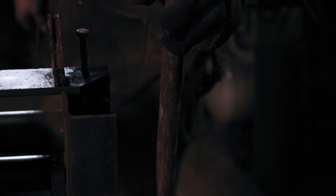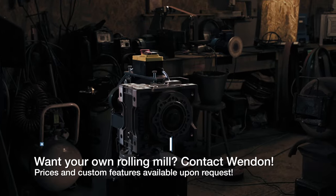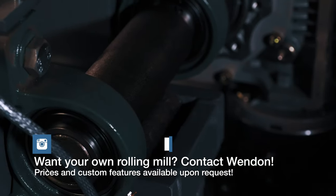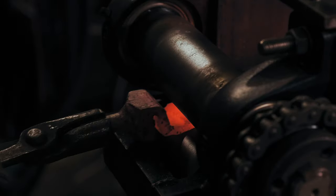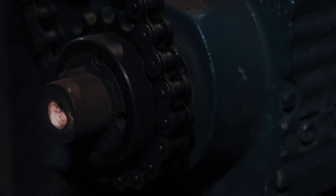There is also a side lever which works on a cam, which adjusts the lower roller, and you can put tapers in, which I don't include on the ones that I make for other people. I have known it to actually part the steel. If it tries to curve on you too much, it will try and rip the grain of the steel apart.